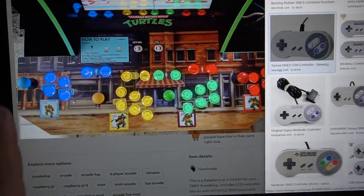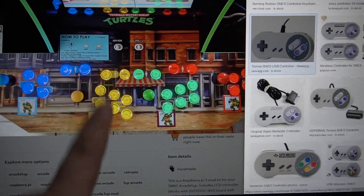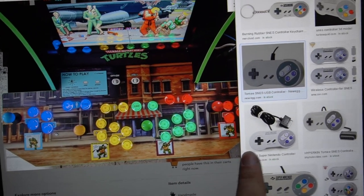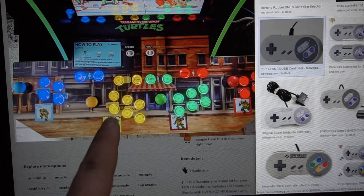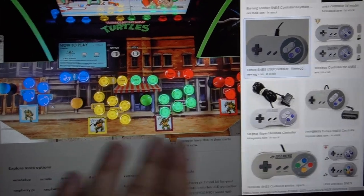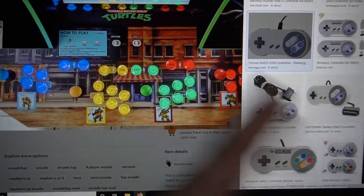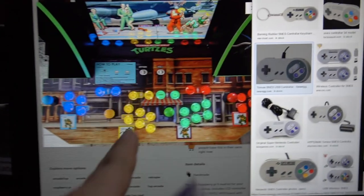The only thing missing on this picture are the four admin buttons. You don't need admin buttons but I do suggest putting them in. Admin buttons go on the same encoder as player one - always player one. My customer put admin buttons at the bottom of the controller. Make sure that is configured to player one's encoder - if it's not on player one's encoder, it won't work. For the admin buttons you could do any button configuration; I usually put them towards the last set, like buttons 9, 10, 11, and 12.